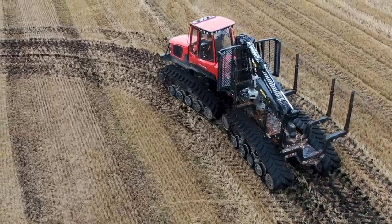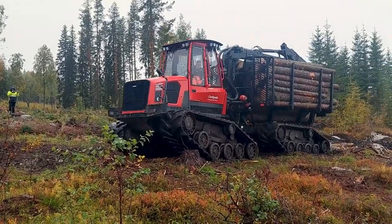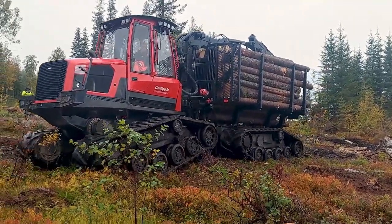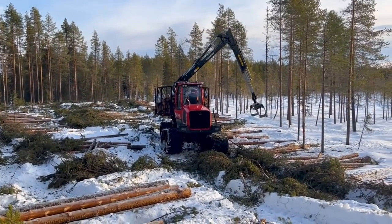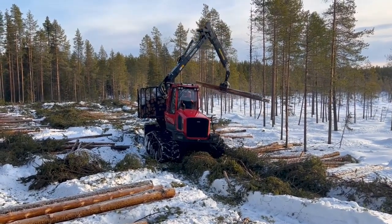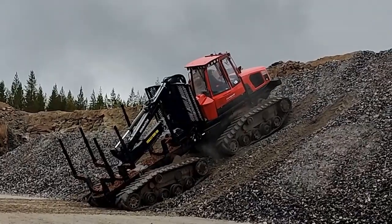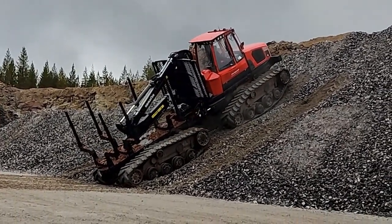Centipede has been developed to meet the challenges of forestry and offers 3 important benefits: lower soil compaction, increased productivity, and better work environment. The machine is built to reduce the risk of ground damage, to increase transport speed and to reduce whole-body vibrations for the operator. The machine has a newly developed forestry track system, with a large support surface to minimize ground impact. It also has a fully suspended chassis to handle uneven ground conditions, enabling the speed of the machine to be increased significantly without the corresponding increase in vibrations.